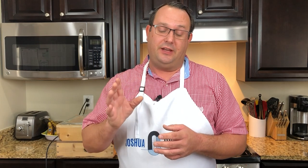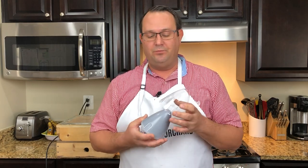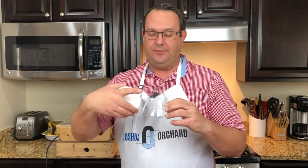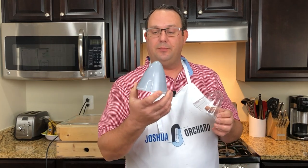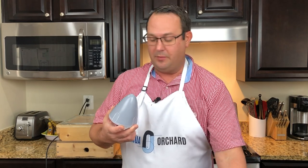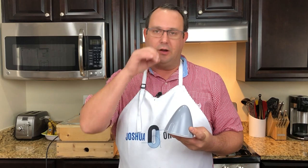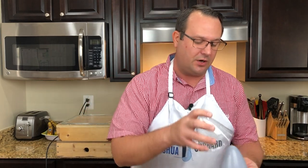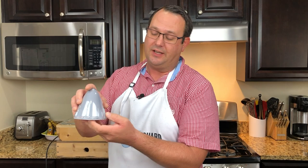Now helper objects are great. Here is a failed vacuum pull of the same part — the reason it has failed is because I got these webs on each side. That's a result of the vacuum pulling process. So when I place this on the pegboard to pull, I'm going to try to position each one of these recesses toward each of the corners of the plastic, because that's where the webbing occurred. Hopefully if that webbing does occur, rather than being in the middle, it's going to be right on that recess.